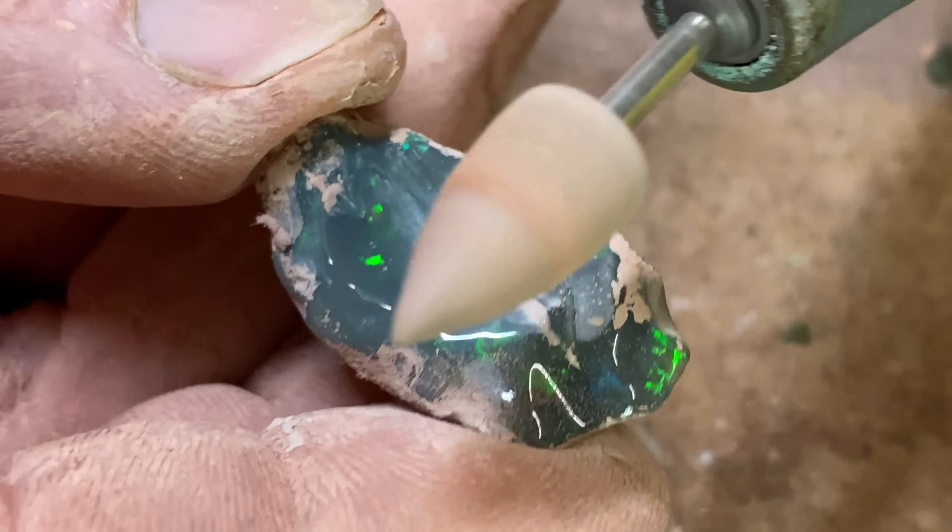We finally finished — it's been two days and lots of abrasives. I've gone backwards and forwards on abrasives because I missed spots and found more cutting marks, so I'd go back to the rough diamond tip then further down again. It's a good idea to loop the opal and look very closely at where all your scratches are. After a few sleeps and many cups of coffee, we've finally got a nice polish on the piece. I've left the rough part on the back so you can see it looks like a natural knobby. I just wanted to make a nice video of carving and exposing the colour bar with a Dremel. Thanks for watching — see you next time.